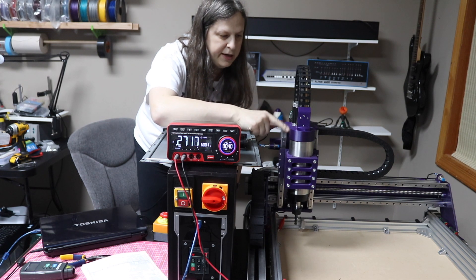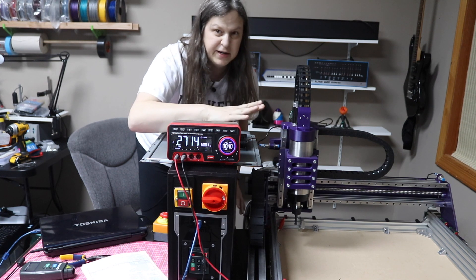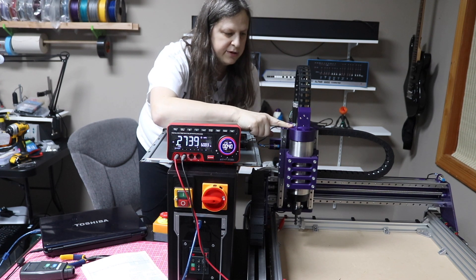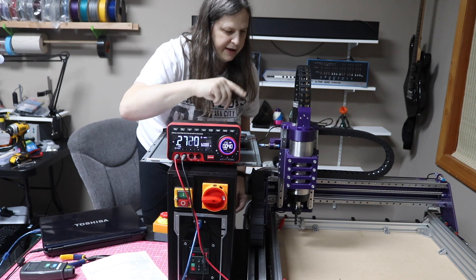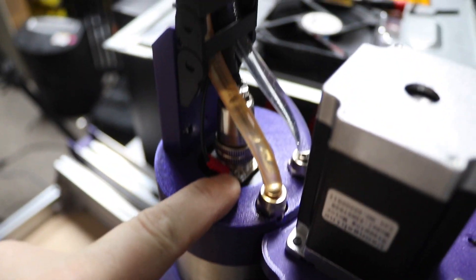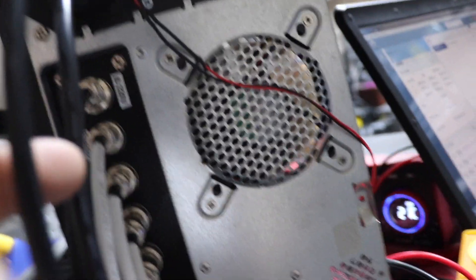I had assumed the fourth pin — not one of the three phases — was connected to the outer part of the connector, but I never tested it and it turns out it's just not connected to anything. So I needed to rewire the plug so it connects to the shielding instead. I tested that the shielding does connect to the bit. I've gone ahead and rewired it so it's now attached to ground, and I also had to attach a ground wire running along the cable chain out to a screw, so now the case and spindle are both properly grounded.